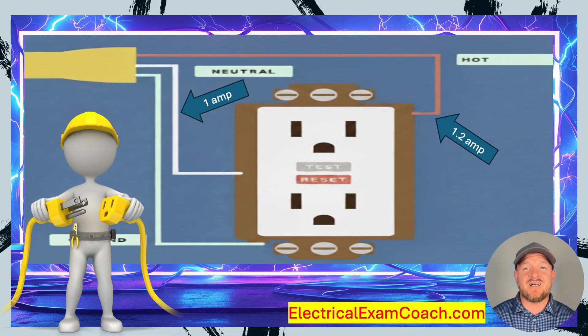So that's what a GFCI does, and it needs no ground wire to function. If I've got one amp coming in on the hot, I better have one amp coming back on the neutral. Now, the ground wire could be one of those unintended paths that current takes back to the source, and the GFCI would function as well — but the ground wire is just not needed.